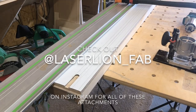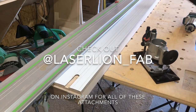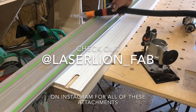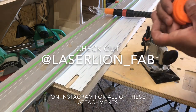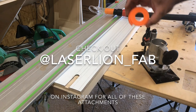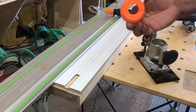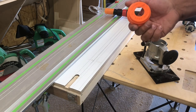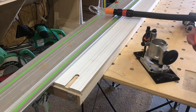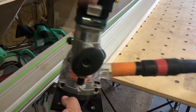The Makita router is not known for its great dust collection on the plunge base. I have the vacuum running, but it's just too big of an opening so it doesn't catch anything. It's better than nothing, but it sucks. My man Darren made the dust dome and that modifies this to where it traps a ton more dust. This is actually going to be my first time using it, but he's shown it several times. The amount of airflow difference is insane.